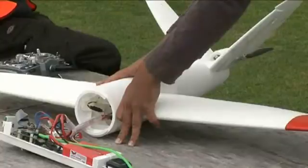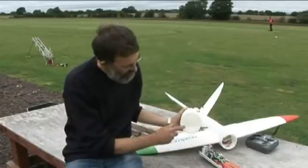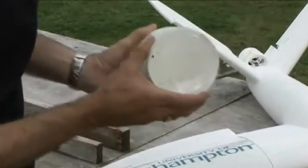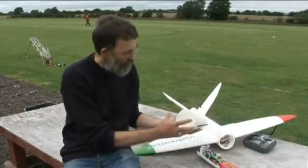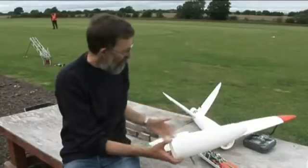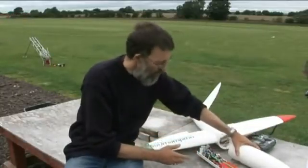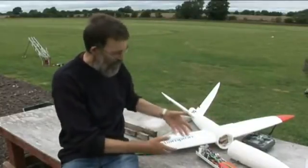The great benefit is that you can have it as complex as you like. If you look at the inside of this structure, you can see really nice, complicated structural design, which makes it very efficient. You can see on here that there are fixtures which enable the thing to snap together — clips. This kind of complexity would ordinarily involve lots of different manufacturing operations and lots of different parts. With laser sintering, we make it as a single piece. This entire aeroplane is made from four pieces: the red wing, the green wing, the nose, the fuselage, and then a separate fifth tray to carry all the avionics. The hinges are made integral with the wings, so the flaps come out pre-assembled.